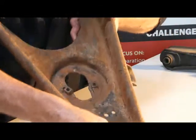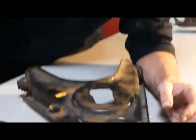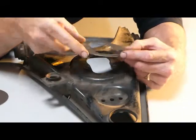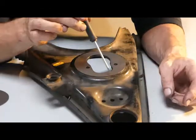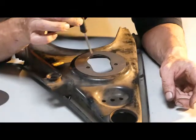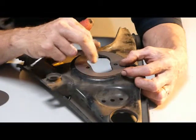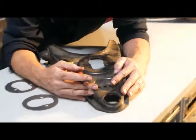So in order to avoid this type of fatiguing, it's very simple: you buy one of these little plates from us and bolt it in place, then seam weld with your favourite TIG set around both the outer diameter and the internal diameter. The laminate you've now created is plenty strong enough for any rally. That's what we do to the 140 lower wishbones.